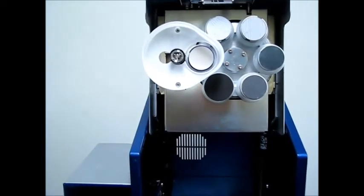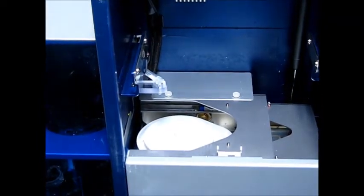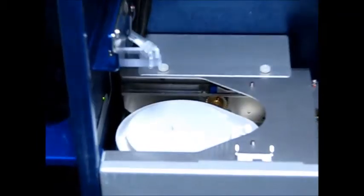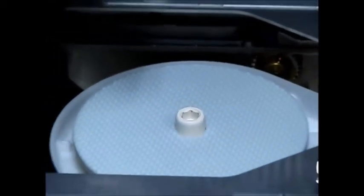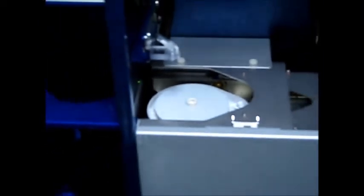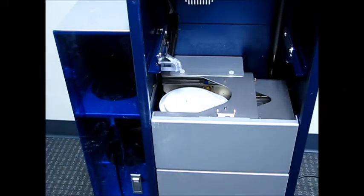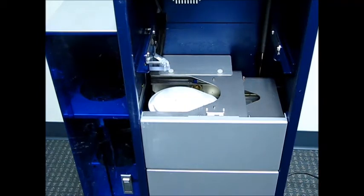Then, down on the bottom in that plating table, in the center of that plating table is the center pin. That's what goes through the hole of the disc. It's that white plastic pin. If you look down in the middle of that white plastic pin, you're going to find a small metal Allen screw. And there's a black Allen wrench that came with your machine, and that's to remove that screw. Then you can remove your plating table.